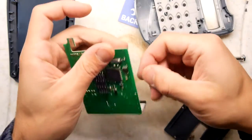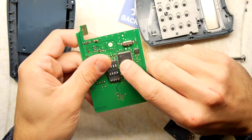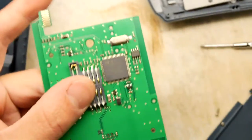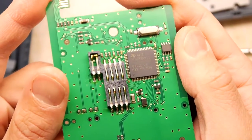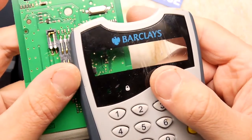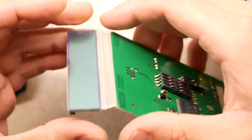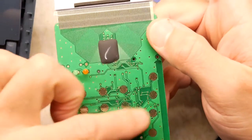Right, so let's see if we can see what this is. This is an ST chip — it's a 7FS CR1R41, and SWP113162E. So if you're in any way knowledgeable about those chips you might be able to get a feel of what that is and what it does. Of course, it's a Barclays unit — are we hacking the bank? The police will be busting down my door soon enough. So there's the usual LCD type display, two line, hexadecimal, and a driver for it — a driver under a blob, which is quite nice — and then just a very simple keypad.